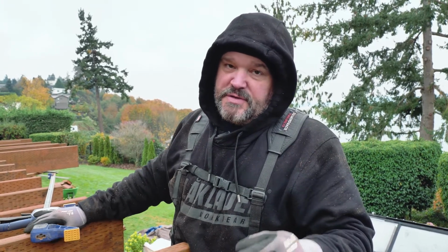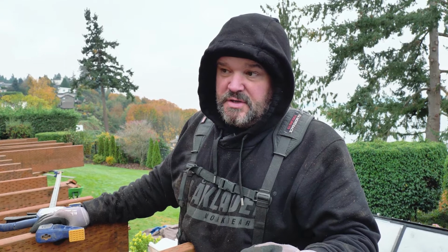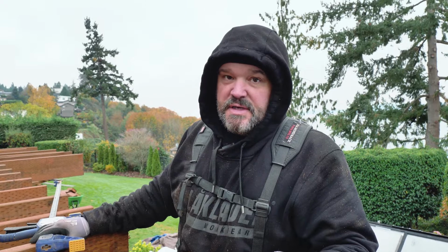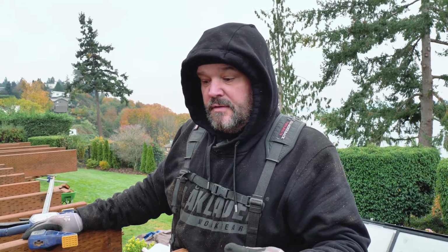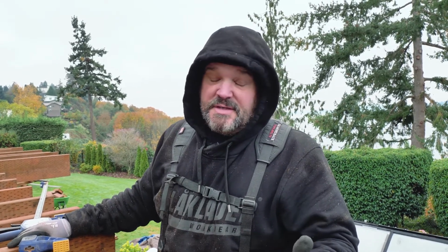I have to do the same check down on the far end, but if you don't take the time and do it while you're in construction, I've had guys blam off the entire joist set and the posts were a quarter bubble out. And I'm like, okay, pull all the nails, guys. Pull all the nails and let's do it right. And it teaches them, sometimes you have to be taught what the consequences are when you get ahead of yourself. Now, I've personally done it myself as well.